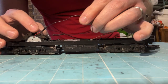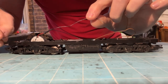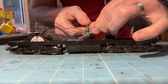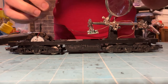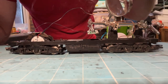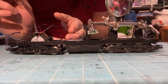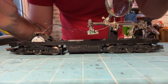I've got two black wires here so I need to trace which one goes back to the red motor terminal — it's this one. I'll tuck the other one out of the way into the coupling. The wire going to red goes onto the tab with the 'O'. I'll bring my third hand back in to hold the PCB, strip the wire back a little, tin the end, and attach it to the PCB. Then I do exactly the same with the other wire onto the diagonally opposite corner.